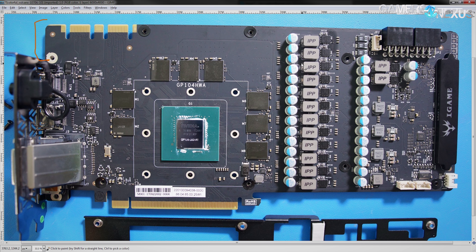Up here we have what I suspect is the 1.8V rail, which NVIDIA cards require for some internal PLLs on the GPU core as well as their BIOS system. On cards with GDDR5X this would also be used for the VPP line of the GDDR5X chips, but the GTX 1070 Ti uses GDDR5, so basically this is here just for the BIOS system and the GPU core.